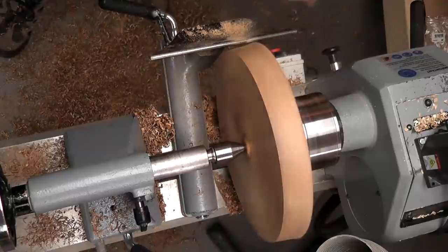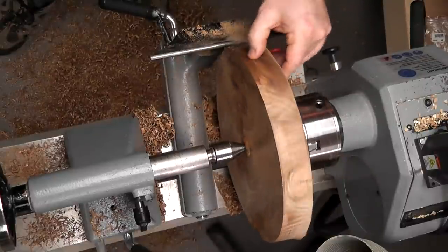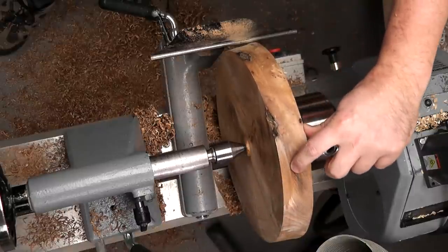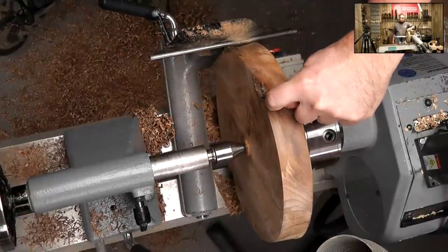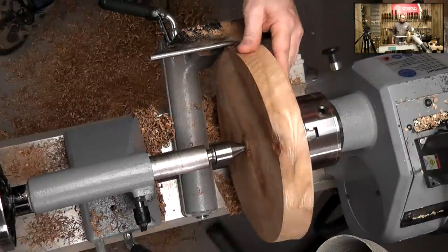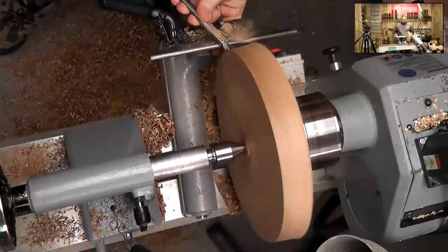And we are. Now, we've hit a bit of stone because my gouge has immediately gone blunt. So it's, yeah, it's right here. So there's a bit of silica in there. We have a little silica vein running through. You can tell what's happened. The minute I hit that, there's a little ridge that's popped up here, and that gouge was really struggling to push forward. So unfortunately, that gouge has pretty much had it. So give me 2 seconds. Let me just try and use another part of the gouge to straighten up that cut.